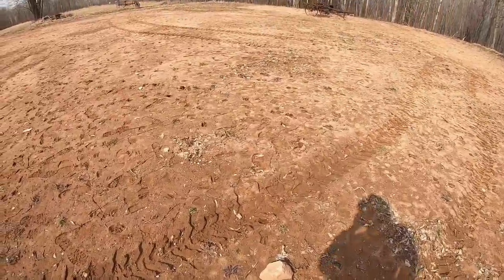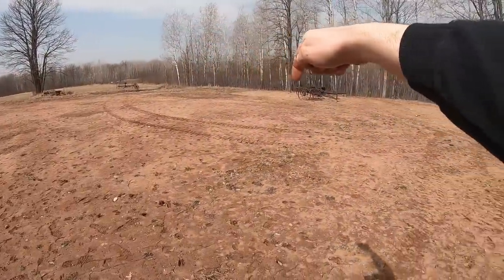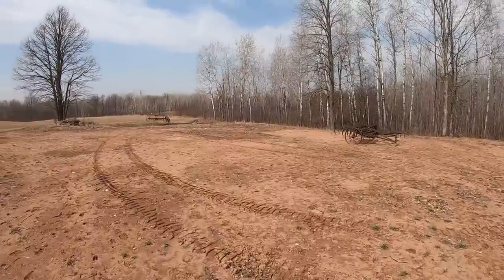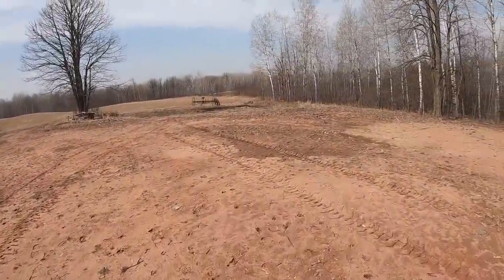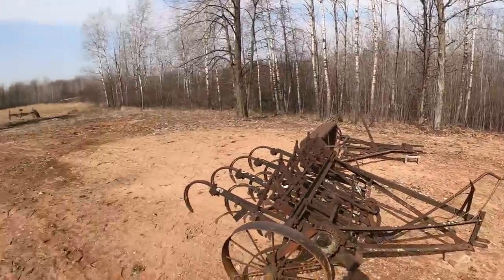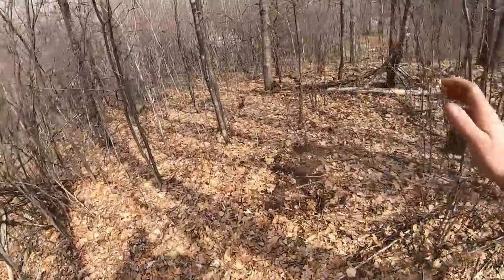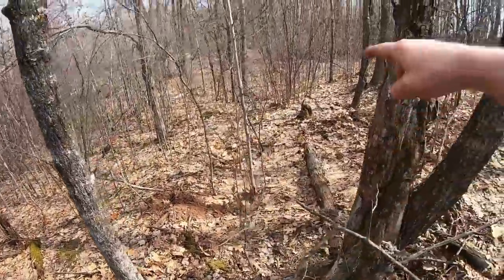Here's my deal — right where I placed this rock is the corner of the building I want to put here. I have the other corner right off the tip of my finger about there, and the other two corners go just to this side of the cultivator and the tumble bug. I'm liking this spot — it's looking really good. My problem though: I was out here with the transit earlier this morning and the wall on this side is about where it needs to be elevation-wise, but when I get down here I'm still like six to seven inches low. I'm pretty much out of fill. I went down into the brush, dug a test hole there — good sand. Dug another one — good sand. Another one down towards the base of the hill — still good sand.